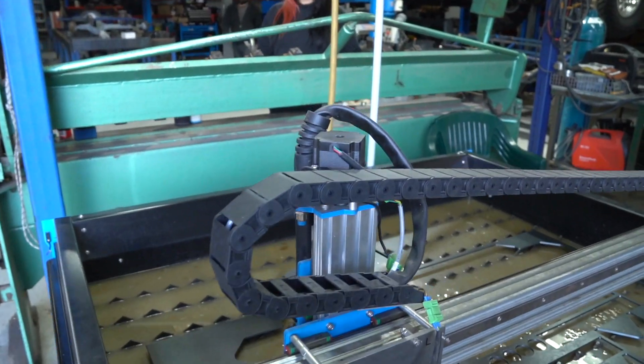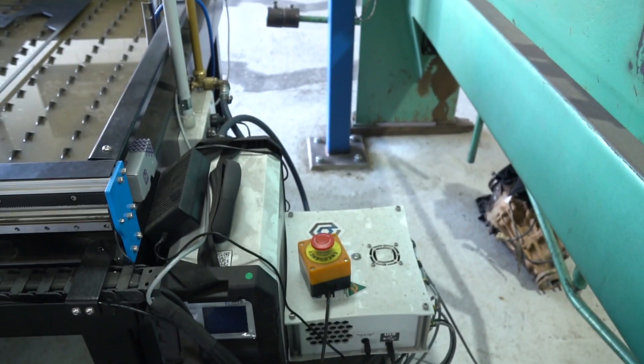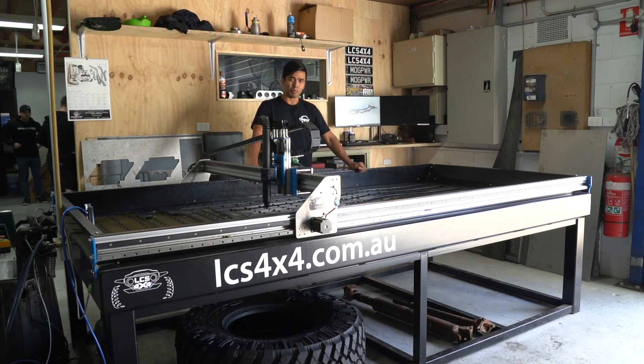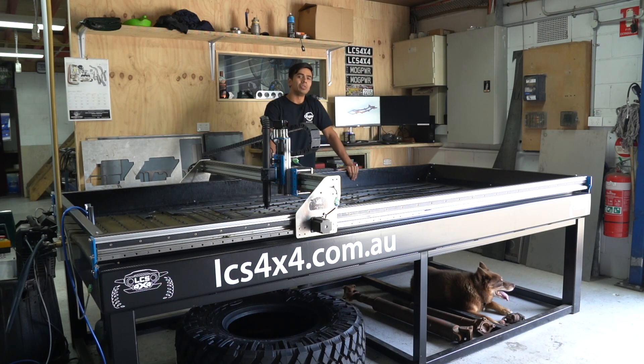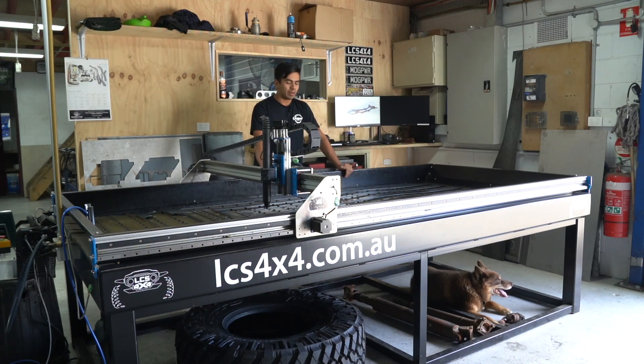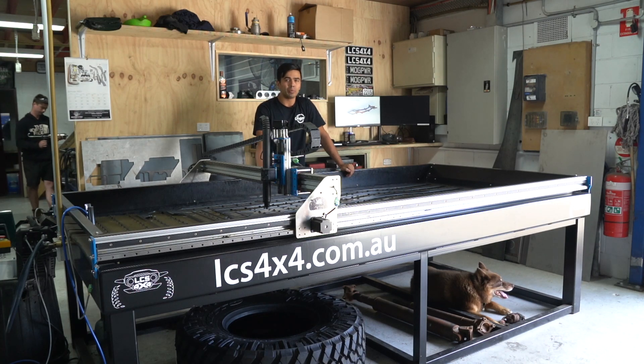This table is using the BlueCarve Spark CNC unit, the BlueCarve Spark controller, and an SWS plasma cutter, and they work beautifully together — the proof is in the pudding with the test cuts. One of the really cool features of the BlueCarve Spark is it has automated height control, which uses voltage feedback to automatically adjust the height of the tip, so you can cut over things like corrugated roof sheet. We've tested this out on checker plate and it worked really well. The variable height control can also adjust when a sheet buckles, which does happen — although less so because we built a waterbed, which is one of the reasons why we built it.